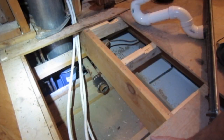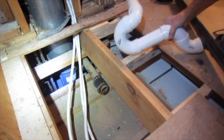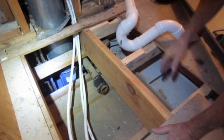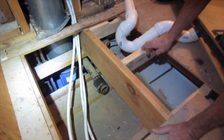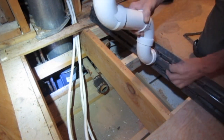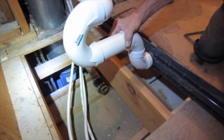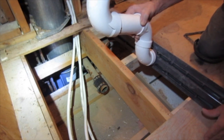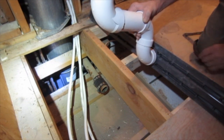I've run all of my new plumbing — my supply lines over to the other side, my shower head supply — and I have a rubber connector here to the copper. I have my blocking in place and I left it big enough to get this all down there. You also need to notch out your blocking to accommodate the extra space of the PVC drain. You've got maybe a half inch here, which typically works with a three-quarter inch subfloor and a quarter inch backer board, but when you get in here there's not enough and you need to just simply notch those out.